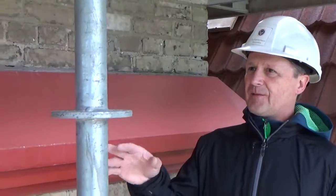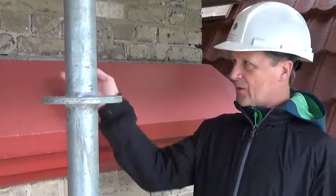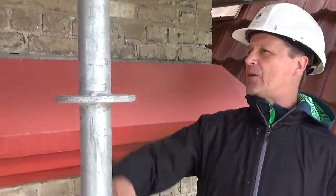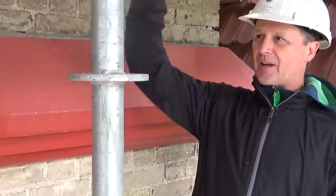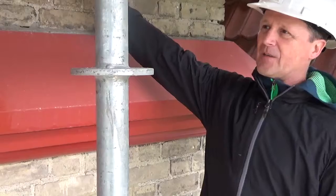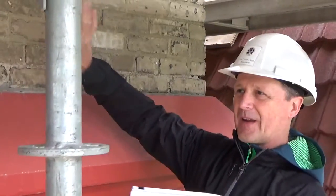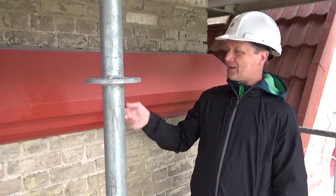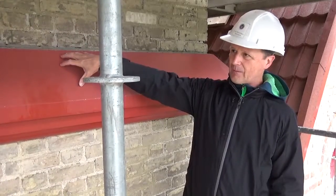You know, in Toronto, a lot of the 50s and 60s apartment buildings that use the brick veneer, they have failures happening, and because they go up, let's say 20 stories, 15 stories, rather than provide access through scaffolding to get up and do the repair work, they've clad it in a metal siding system, so any failures that are happening are being held in place by sheet metal. It's not the right thing. Eventually you've got to deal with that. Yes. And that's what's going on here in a smaller location.